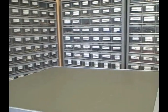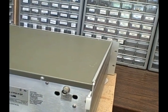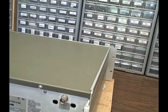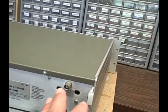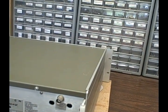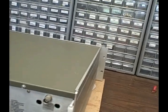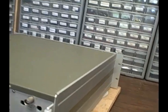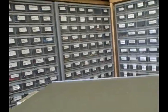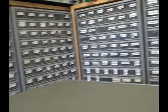There's also something called a picket fence output, also known as a comb output. Essentially it's an output that displays all of the harmonic frequencies derived from the 10 MHz oscillator that are used internally within this system, generated through a mass of mixing and filtering.